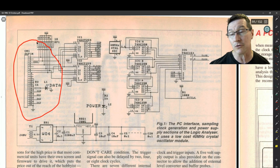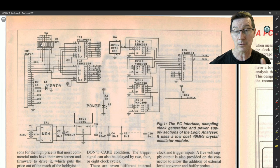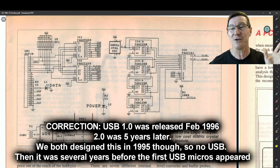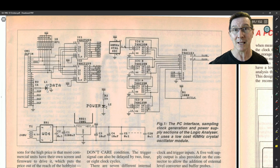Why did we both use the parallel port? Well, that was the obvious choice back in the day. We could have used the RS232 serial port with a microcontroller to read serial data, but then you'd have another programmable device and a slow interface — 9600 or 115K baud maximum. And you had to send serial commands. No, it just wasn't a thing. Remember, USB didn't come out until probably 2001, and that was USB 1.0. So in the mid-90s, the PC parallel port was still the interface of choice for interfacing to a PC, unless you designed a plug-in ISA card.